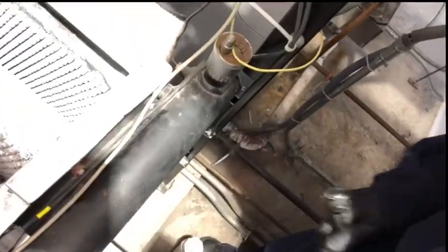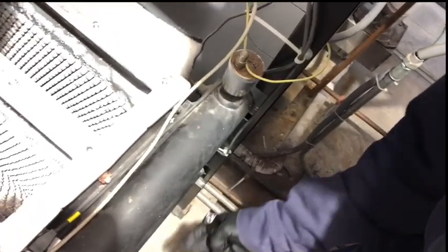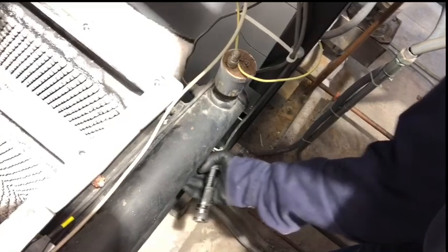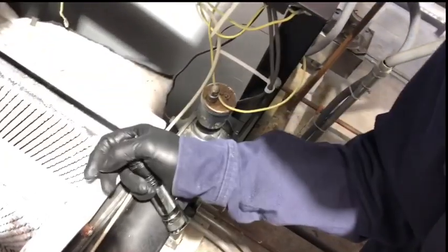So we're going to get the hose and we're going to wash all this out. I'm going to leave the collector box on down here at the bottom until I wash this out real good. That helps trap my water and keep me from having a major mess down here. Then I'm going to remove this collector box because, like I said, it is leaking and I need to get it resealed. And once I get that out of the way, I will cover this over the top and I will hose from up underneath it here. All this stuff is going to stay inside until I'm completely finished.